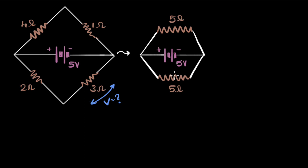Now that I've reduced the circuit, I ask myself: can I find the voltage and the current across these two resistors? Yes, because notice these two resistors are directly connected across the battery — they are in parallel. If this point is A and this point is B, then the voltage across A and B is five volts. These connecting points are all A or all B with nothing in between, so the voltage across each of these resistors is five volts.